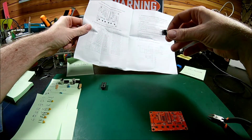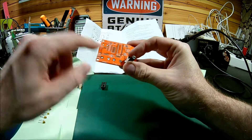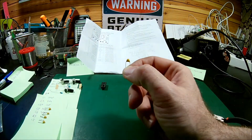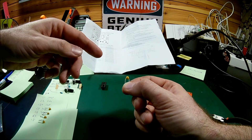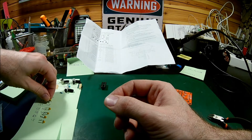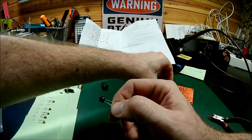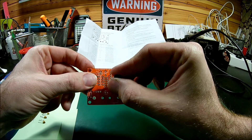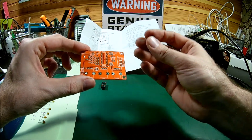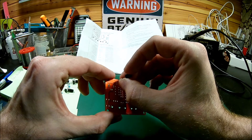If I'm correct, the 100K is the coarse setting — the B104 goes all the way to the right, and then the 50K and 50K here. So it's not that hard. If you are new, these small capacitors — the yellow ones — have printed numbers on them. It's basically the same system: this is a 104, that's 10 and then four zeros, so 100,000 pF. All the numbers are in the listing. And when you come to an electrolytic capacitor, remember to turn them the right way. On the PCB it's marked with a crossed or hatched section — that's the minus. Check the capacitor as well, there's a marking for the minus.